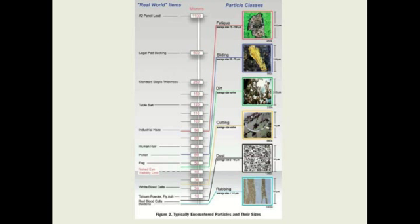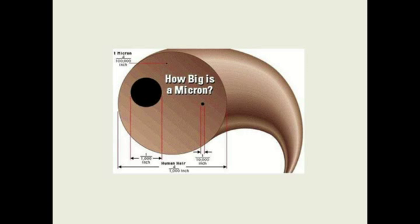If you take your hand and run it across the door seal or the top of a picture in your house or your office, the dust particles that are on your fingers are going to be particles that are 40 and 50 microns. And those are like boulders in between a gear or a bearing surface. So we've got to filter those particles out, and we've got to keep those particles away from our lubricants.